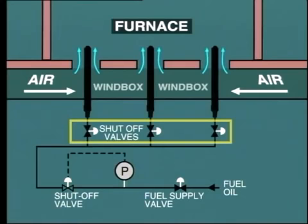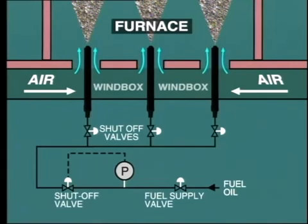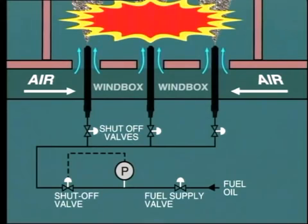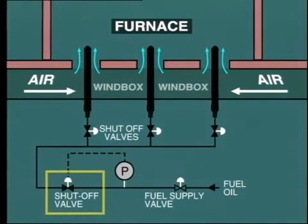This safety action is important because imagine what would happen if the faulty control valve were to suddenly open again after, say, 30 seconds. You can imagine the large quantity of gas or fuel oil entering the furnace with no flame or source of ignition. It would mix with the air to form a highly explosive mixture, which, coming into contact with hot boiler tubes or refractory, could actually cause a tremendous explosion. This potentially hazardous condition is prevented by the closure of individual burner fuel valves by the flame detectors. Additionally, loss of fuel pressure will cause the shutoff valve to close.